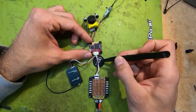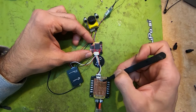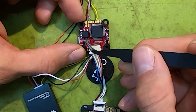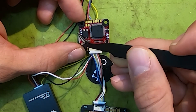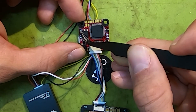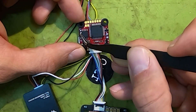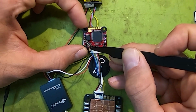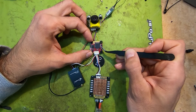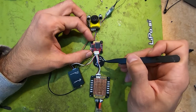On the bottom you have your smart audio, ground, voltage, and video signal. On the bottom you also have your power going to the FC from your ESC. As I explained, you can easily customize this wiring harness to fit your ESC. If you are using Crossfire, I'll use the bottom UART 4 pads — you have TX, RX, ground, and 5V. It's really convenient to solder your Crossfire here. These two pads are for your buzzer, and you have ample UARTs for your other accessories.